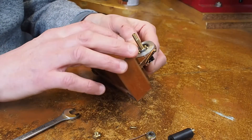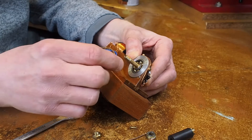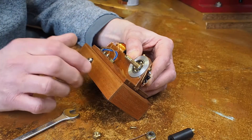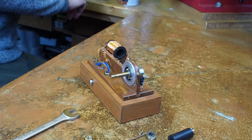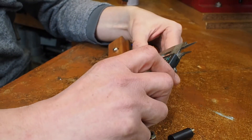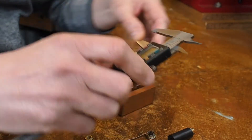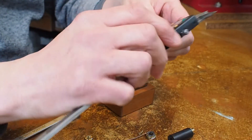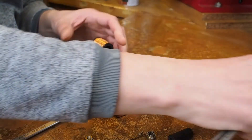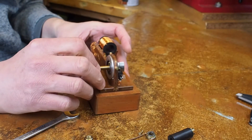I've actually got a single bearing. That sounds strange in a main big end, but there's not much load on this, so it's a single bearing. Eight millimeter internal diameter, 22mm outside diameter. The digital caliper is playing up a bit — it's cold — but I'd say it's eight millimeters wide. So it's an 8mm ID, 22mm OD, 8mm thick bearing. That operates this really simple little switch.